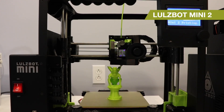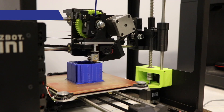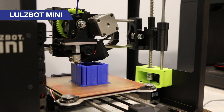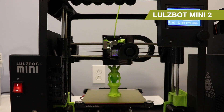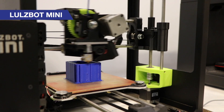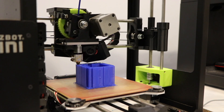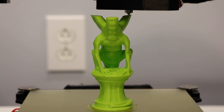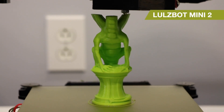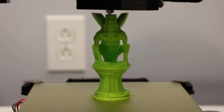There is a PEI coated plastic side and a glass side, and presumably over time you could add other print bed materials. The print volume has increased by almost a thousand cubic centimeters, going from 3,650 cubic centimeters on the Lulzbot Mini to 4,608 cubic centimeters on the Lulzbot Mini 2. That's a print area of 152 by 152 by 158 millimeters on the Mini, moving up to 160 by 160 by 180 millimeters on the Mini 2. It's not much, but it's something.